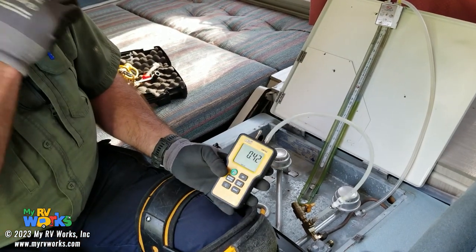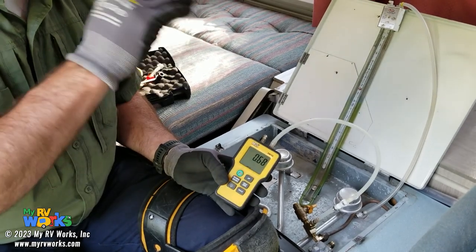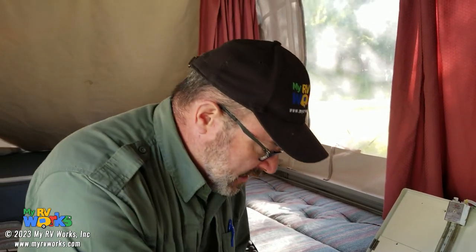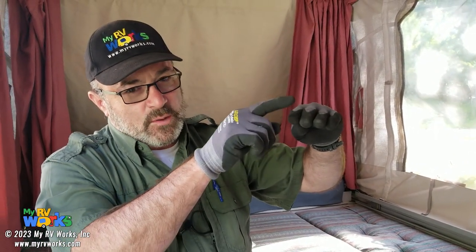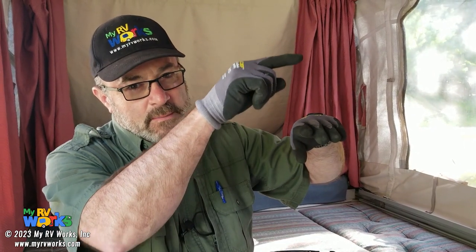But anyway, you get this number to 8, which is not at the maximum lockout pressure, but also not at the minimum pressure. And you're going to be watching that number. If the number starts to go up from 8, let's say we've established our lockout pressure was at 14, okay? So if you start off at 8 and the thing starts to go up, that means there's a problem with your service valve. The service valve did not close all the way. So maybe there's an issue there, okay?